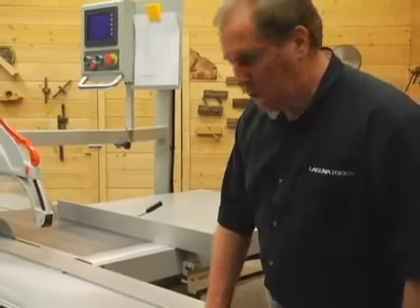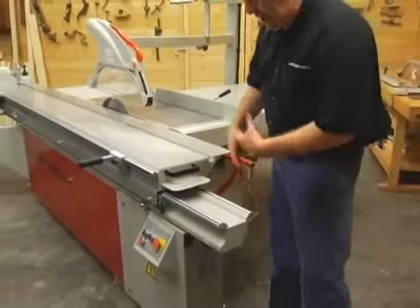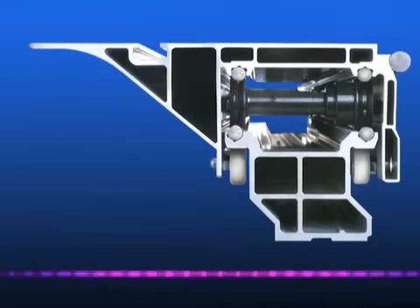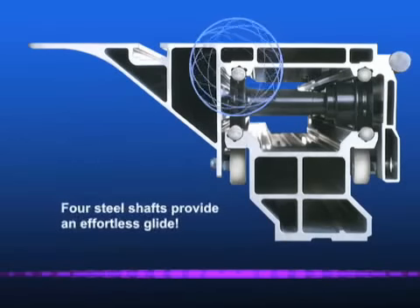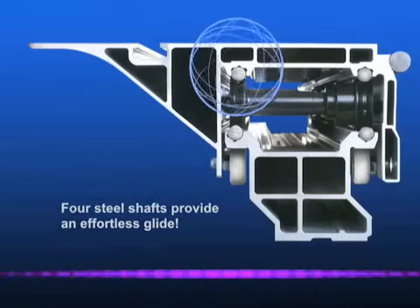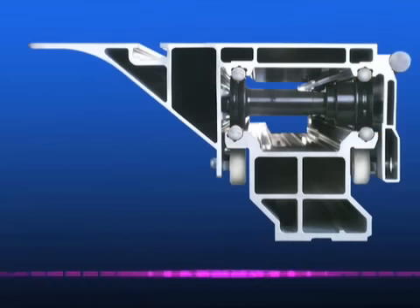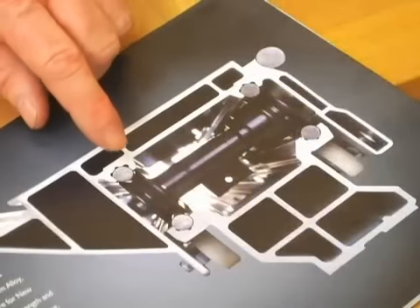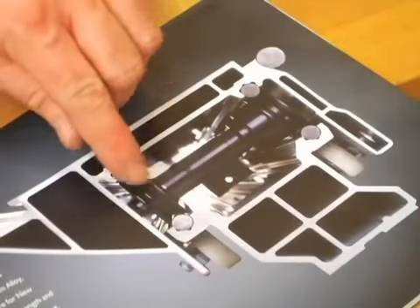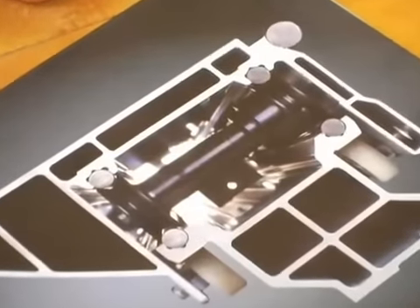While we're moving the slider, you can see just how effortless it glides back and forth. There are a number of reasons behind that. You'll see these hardened steel shafts right here, and the table rides back and forth on these on a double — what we call a dumbbell system. You'll see this roller assembly in here; we call this a roller bogey, or some people call it a dumbbell because it looks like a dumbbell. There are also wipers — little brushes that go through and brush the dust off these rollers to keep them clean so the table rolls back and forth smoothly.